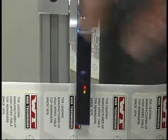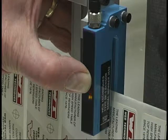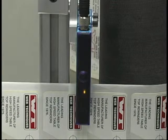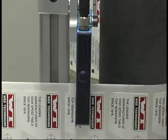To unlock it, push and hold the button for 5 to 7 seconds until the red light goes off — now it's ready to be retrained again. I can now retrain it on this gap; the red light will blink, and when it turns green it has learned the label.